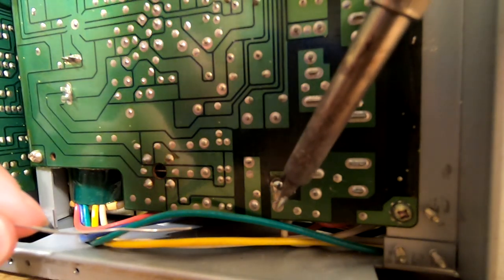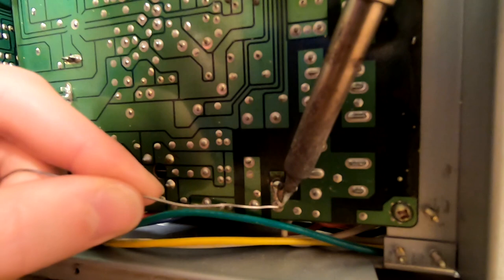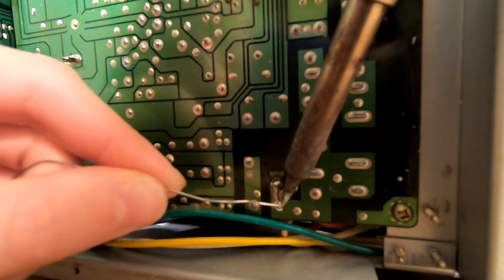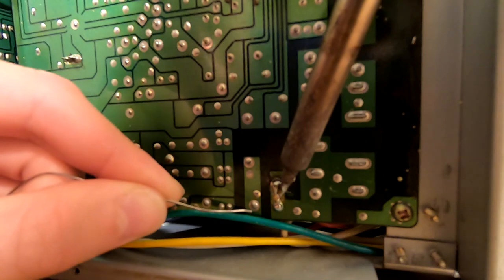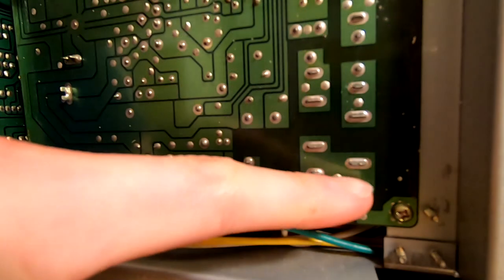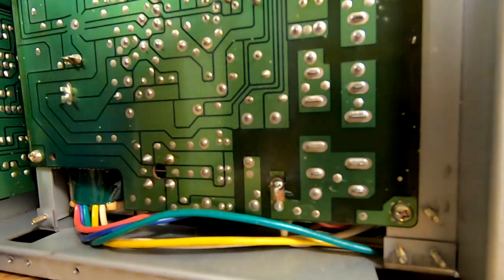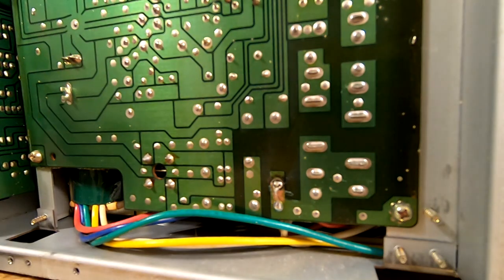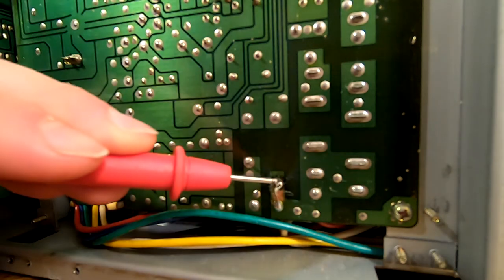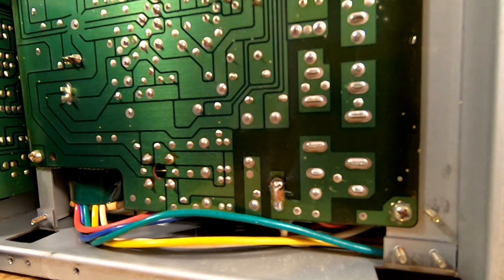We have solder on there. Now here's where it gets ugly — we solder it to this pad right here, and a little bit up there too. That's the dirty fix right there. See, this whole thing right here is one section of copper — this is all the same basic circuit. Let's check it real quick with the continuity meter, just make sure that this is good. You hear the beeps? That means it will be different now, because it did not do that before.